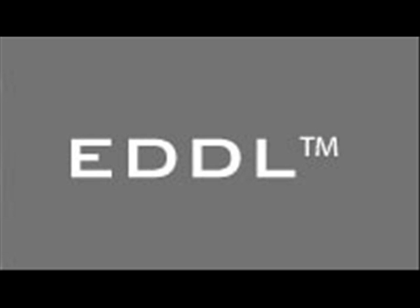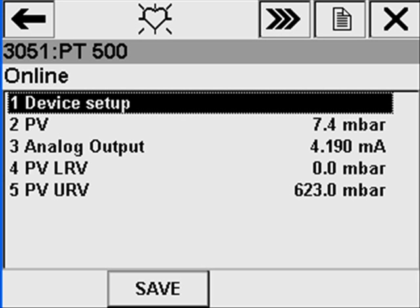Lastly, let's look at the calibration wizard for the same kind of transmitter in a handheld communicator. EDDL wizards work not only on Windows computers but also on handheld field communicators that can be brought to the field for in-situ sensor trim. These rugged yet lightweight tools are highly valued by technicians. EDDL is the only device integration technology supported on handheld communicators.